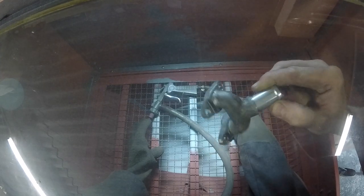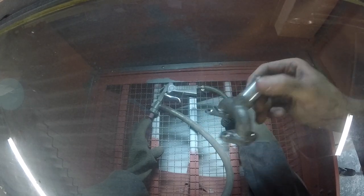I'll carry on looking. Okay, so this is off the power steering pump and that's cleaned up as much as you would normally with just some brake cleaner and things like that. I'll just tape these end bits up to protect them and then we'll give it a blast. Just kind of done that, see if it helps the machine surfaces to stay as is. If not, I'll use duct tape afterwards.